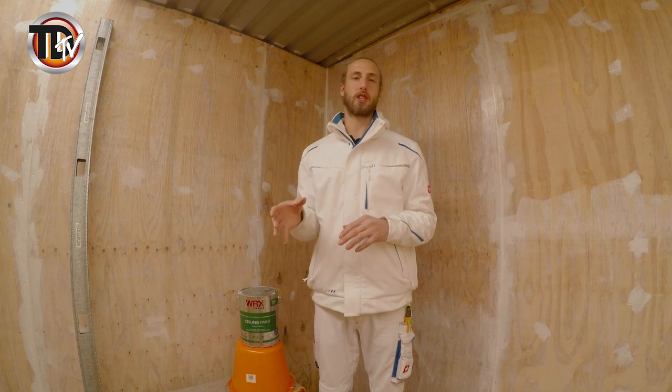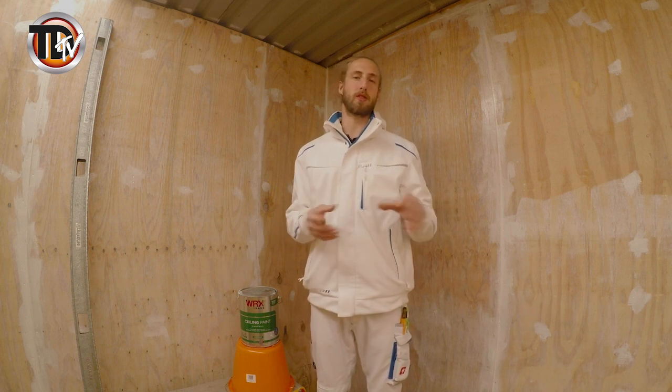I used a fine finish tip on the coving because it's got a slightly plasticky finish on it. It's not a generic plaster coving, so they're very non-porous, the porosity of it's non-existent, so I didn't want to overload that, but overall the coving and the ceiling finished absolutely beautifully.